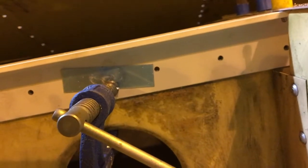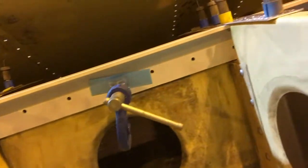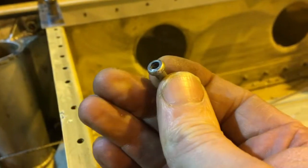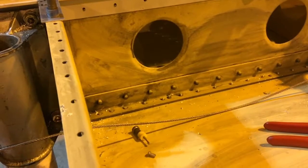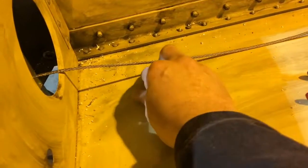I've been drilling for a while now and I've got the pilot holes here — it seems to be going quite well. Where I have a reference plate on this side, they look nicely centred. They seem to have come through pretty much straight. The rest of them as you go further out — there's no surefire way of telling. They get smaller diameter as you go out; I ended up with a very thin-walled one of these guides, but it seems to have done the job. That's enough for today — I'll hoover up the swarf tomorrow.